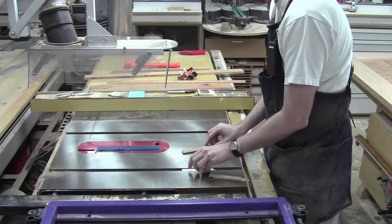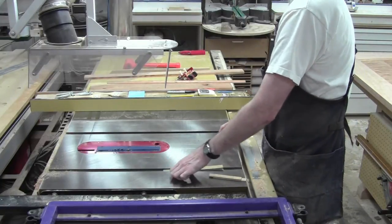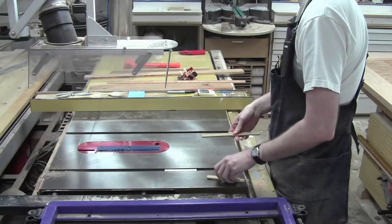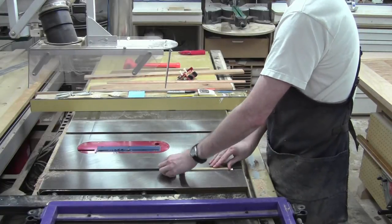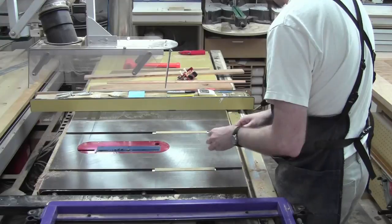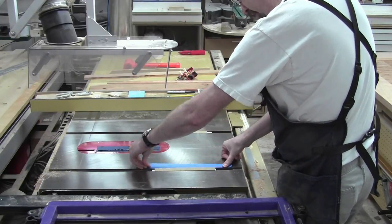And I'm going to put down these guys and set this on it, see how we did. Yeah, that'll work. Okay. So just put a pair of these little spacers down in there. Actually, I have enough of them, I'll just do 2. And that'll give me some place for glue to go. I want to make a spot for the squeeze out to land and not be on my cast iron.